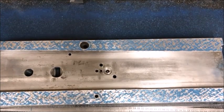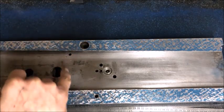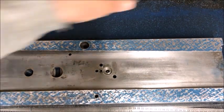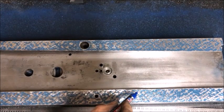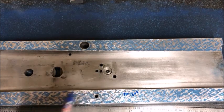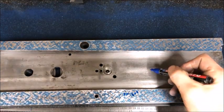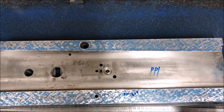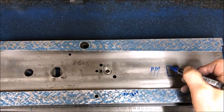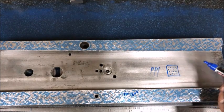Progressing a little bit — not really finished with the rough scraping, still some areas left, but we are nearing the finish stages. Moving to finish scraping means that instead of trying to align the piece — which we have now done — we focus on getting up the points per inch, which we do by cutting each support point into more points, increasing density over a square inch area.